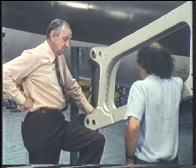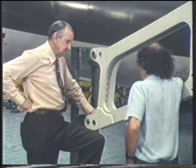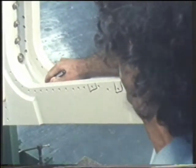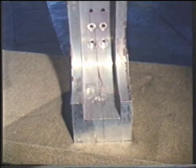And tensile stress? We examined the planning cards and found that the forgings had been machined after heat treatment. So, when they were quenched during the heat treatment, they were in fact at the full section, and this channel was machined out afterwards. After the heat treatment, internal stresses are in a state of balance. Machining out material after heat treatment upsets this stress distribution. Removing a chunk of the forging exposes a tensile stress field. These exposed tensile stresses now act as crack-opening stresses along the centre of the groove, which was exactly where the original cracks appeared.